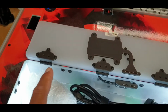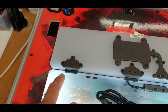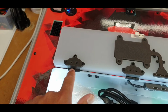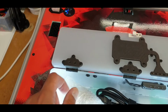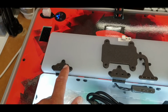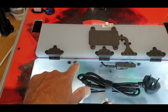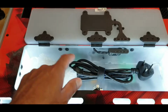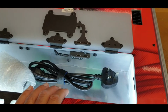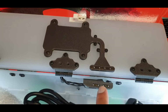So when it came to machining the new lid, I just did the basic cutout to match the hinge, and then 3D printed the mounts at the correct height to put the hinge in the right position for the door. And that's where I'm going to go from now on. And as I do this on any other cases, that would allow me to design the various cutouts on the acrylic storage compartment panels to miss those at the same time. So that'd be great.